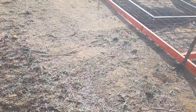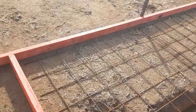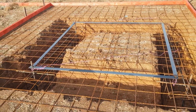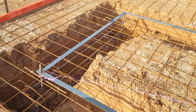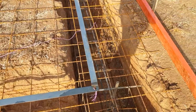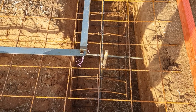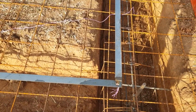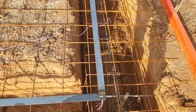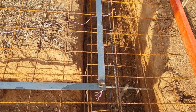Now onto the next problem. I'd like to say done and ready, but unfortunately I need to chip out six inches. I'm going to move my footings across so that I can move the footings cage across, because as you can see the thing doesn't fit.